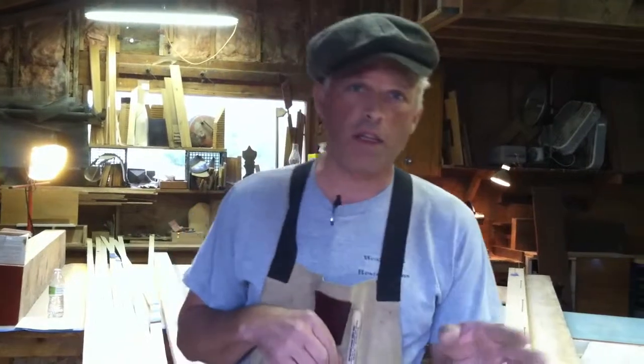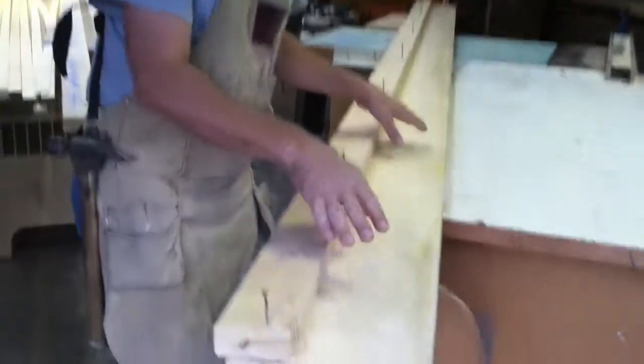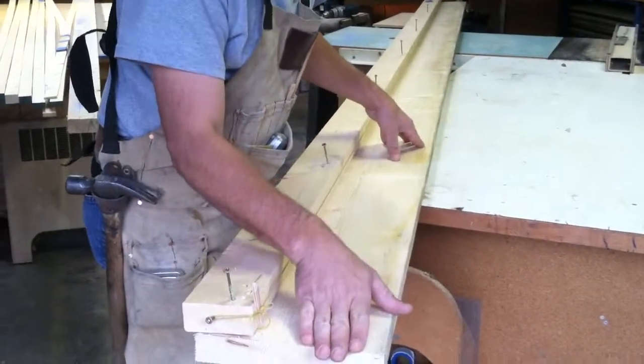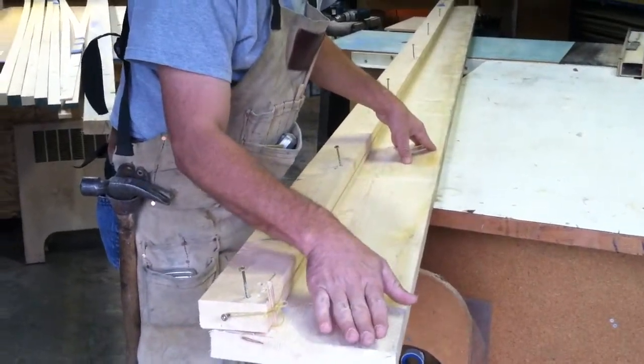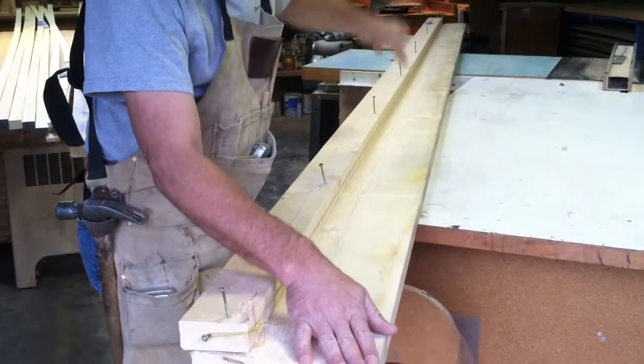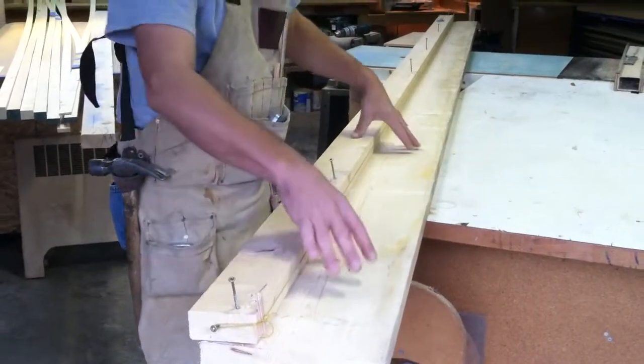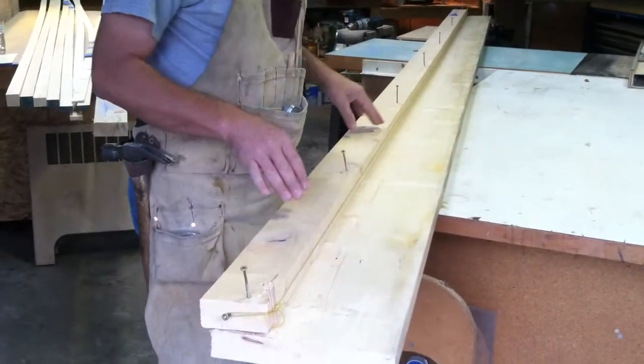Okay, on occasion we have to rip long wedges, and in this particular case it's for slope on a deck for a very specific application. And so I'm going to show you how to do that now. What we have here is a 2x10 piece of dimensional lumber that we're going to use, and we're going to rip it from 0 to whatever we need down there on the butt, which is 1.5 inches. I've already cut the board to length. In this case it's 177 inches.